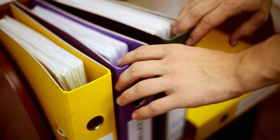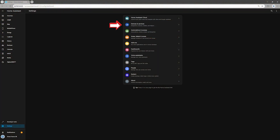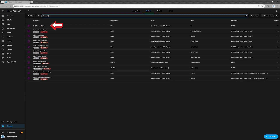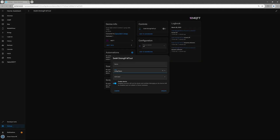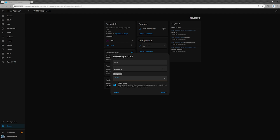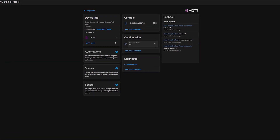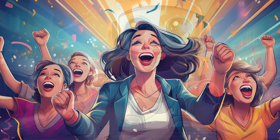Step 4: Assign location and labels. Let's organize like a pro. Open Home Assistant settings and go to Devices and Services. Switch to the Devices tab, find your newly paired switch module and click on it. Tap the pencil icon in the top right corner and assign a room. Add labels to make future automations a breeze. Click Update and you're done. Congratulations! Your Zigbee smart switch module is now wired, paired, and fully integrated with Home Assistant. Does it actually work?